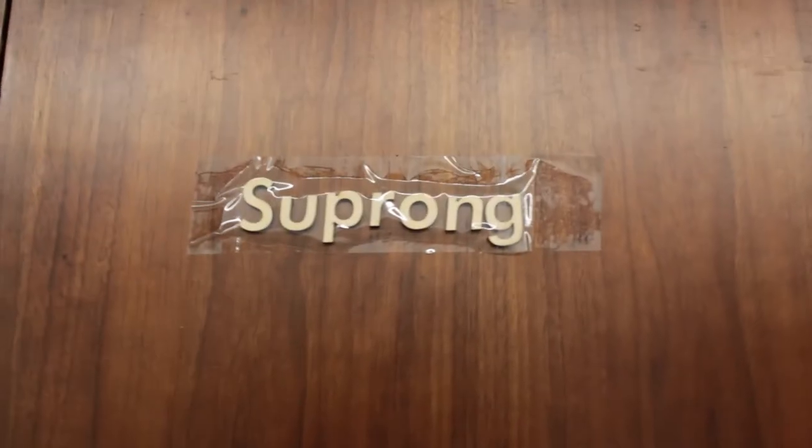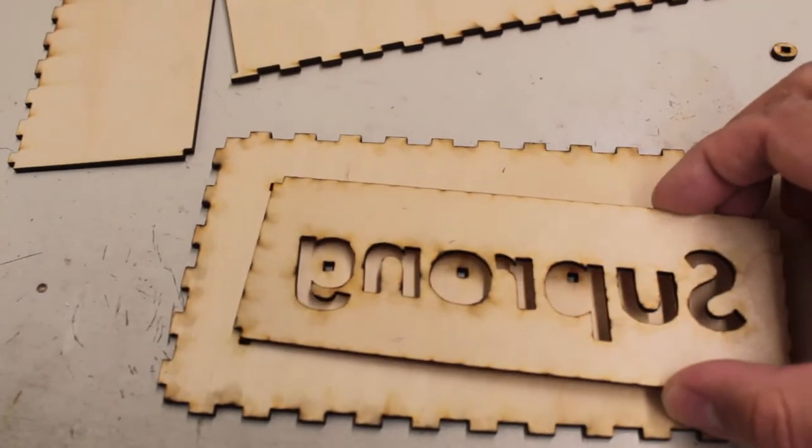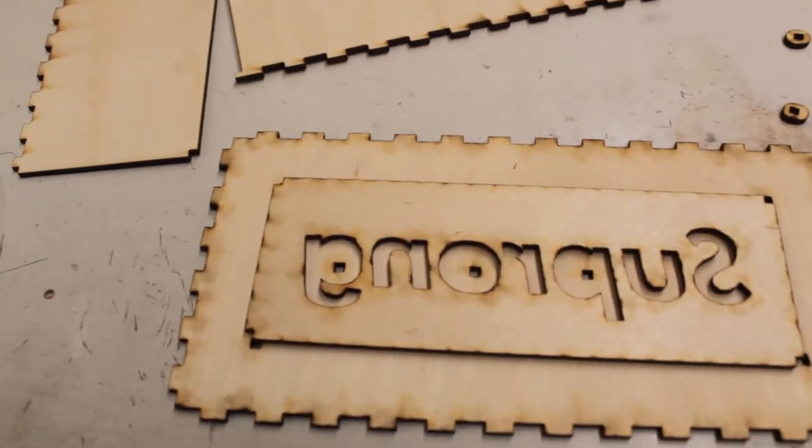Okay, back to it. Let's put our mold together now by starting with a base, and make sure to flip it since this is the negative mold. Everything should snap together. Use tape to hold the mold together. Put tape along all the edges and make sure they have a good seal.